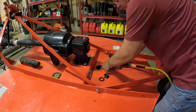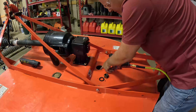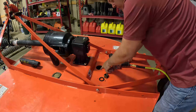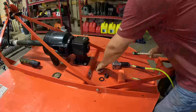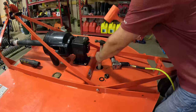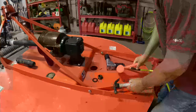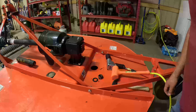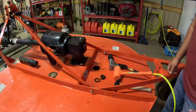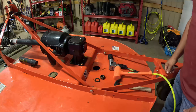I'm going to tap this bolt down using a piece of wood so I don't damage the threads. I ended up using the wooden handle of a hammer and a dead mallet to tap it out — and just that easy, it dropped down on the ground. I'm going to do one blade at a time so I don't get anything out of balance and have one to reference on the bottom side.